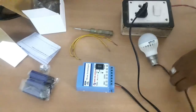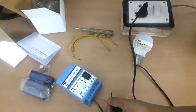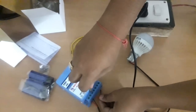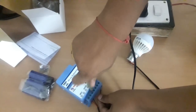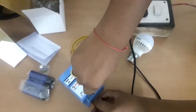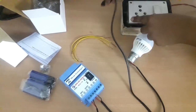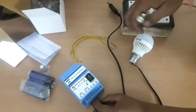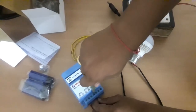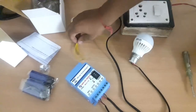When the tank is full you will get the 'YES' indication. Now I am using a bulb and going to connect it at the output terminal — basically you need to connect the motor, but for testing purposes I am just connecting the bulb. The two wires from the bulb are connected as a load at the output phase and neutral. I have now connected input phase and neutral, and output phase and neutral.